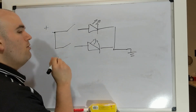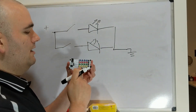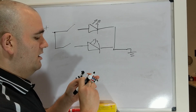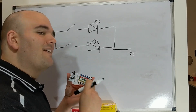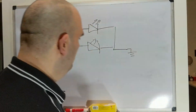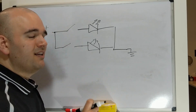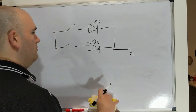That's okay, but it starts to get really unwieldy. In this setup, we would need 16 individual buttons controlling each individual LED. Now, we're using buttons here, but with a microcontroller or any sort of chip, that means you need 16 different inputs. That gets to be a bit much — much less when you get to hundreds or thousands of LEDs or individually addressable components. It's almost impossible to get that many inputs. So we can use a concept called multiplexing.